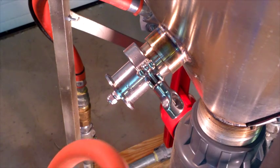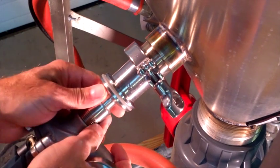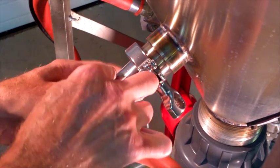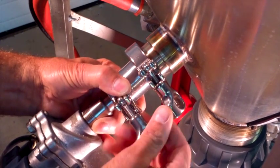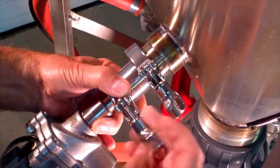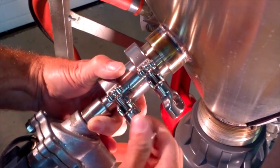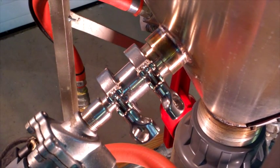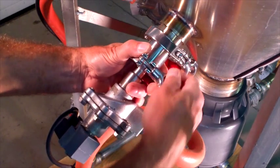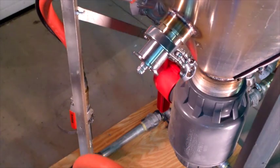To connect the solenoid valve or air supply, a second flange gasket is placed on the rear flange and the NPT adapter is clamped to the rear of the AirSweep nozzle. The components are now in place and ready to be used. Dismounting the components is a matter of simply removing the TriClover clamps and components in the reverse order of assembly.